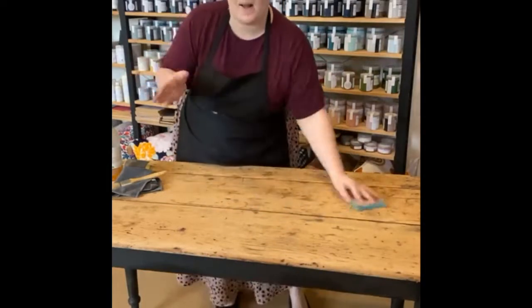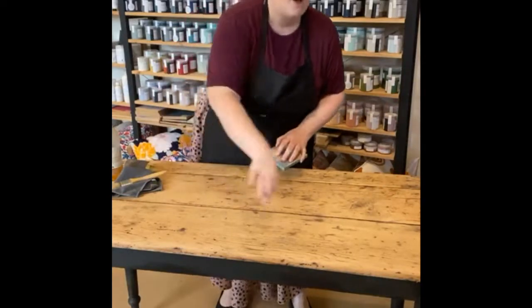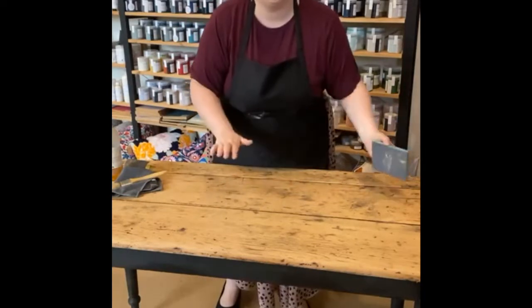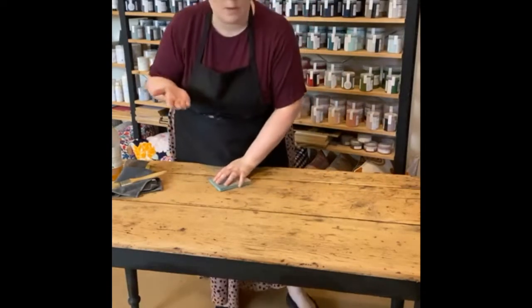This is like a couple of minutes. It's similar to scruff sanding, except with timber you want to make sure you're going in the direction of the grain, which is the lines in the timber. Stick with that — you won't scratch your timber. If I go against it, I'm going to scratch that timber, which is not what we want.